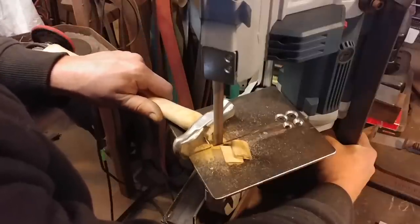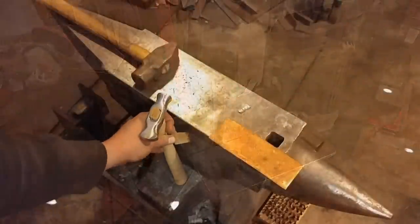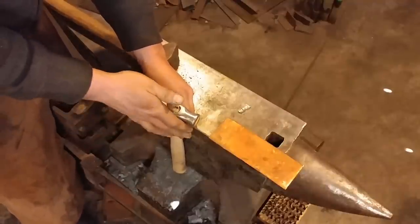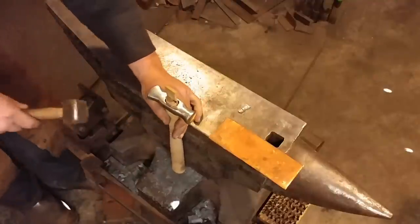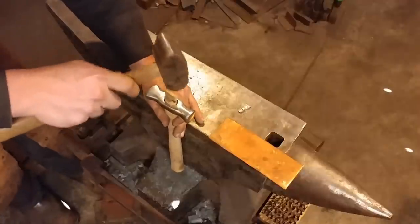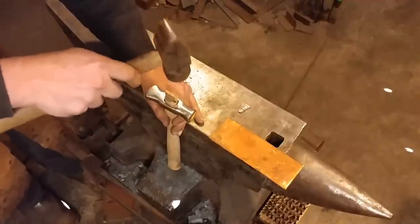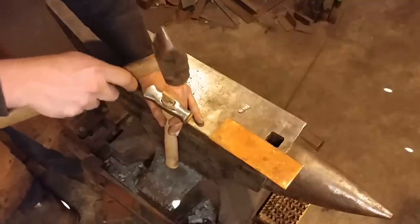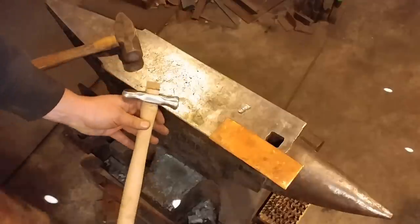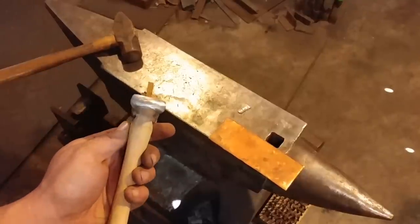I like to have a little extra stick out of the top of my hammer heads — this allows for a tighter wedging fit when you put that wedge in. One thing I didn't showcase is that I put a little melted wax coating on the very front edge of the wedge, just to help it drive down and glide in. I've found that if you don't lubricate the wedges a little bit, the factory-made ones tend to split rather than drive down through. I think they get kiln dried and get so crispy it's nearly impossible for them not to split, though it may vary depending on your location, humidity, and climate.